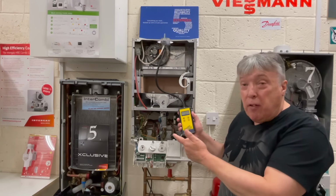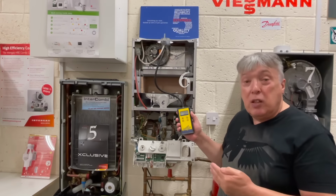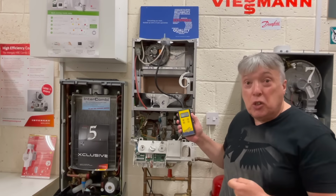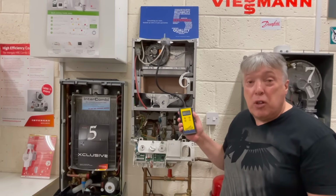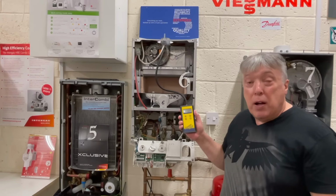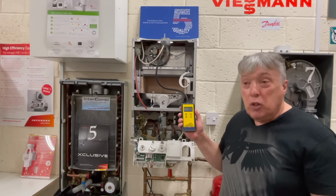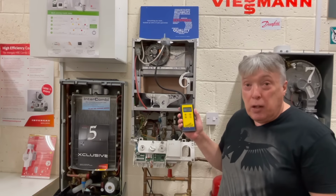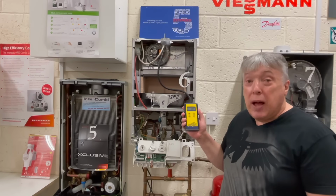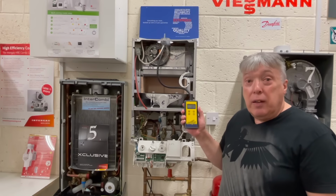So the boiler can't fire up because obviously I've disconnected it, but the hot water will send the fan into full speed. Whereas, as I said earlier, if this was switched on in central heating mode, we could be standing here for 3 minutes, which is not a lot of use. So now we can see how many millibars of air pressure is being generated by that fan and the flue. And you get that information from the factory, so they should tell you. And then particularly on condensing boilers, it's usually written in the manual as well. So this is a really good way of testing a fan.